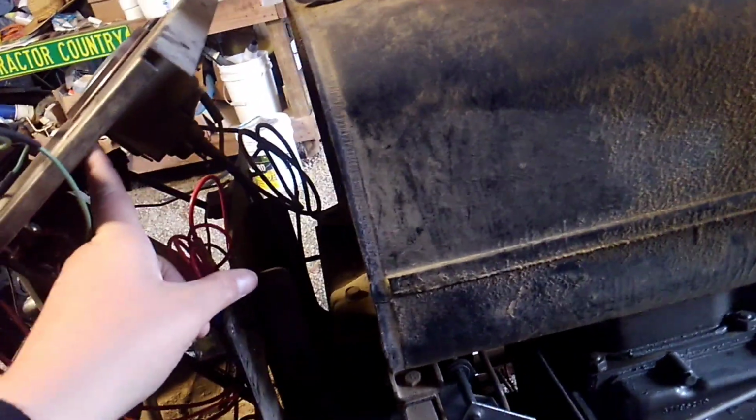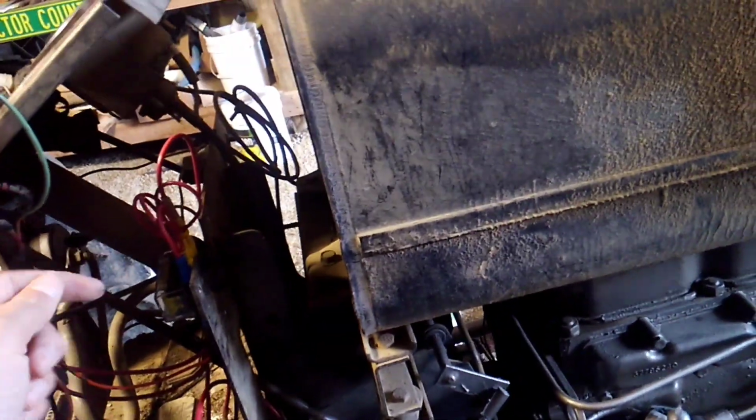And this is the safety switch wire. But what they had done is they had a wire running from the alternator to the amp gauge. Then from the amp gauge, they had a wire going to the starter, and they had the switch wire attached to that too. And so how it was getting charged to the battery, it was running all the way back down to the starter and then going back through the main cable. That's a lot of wires.